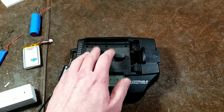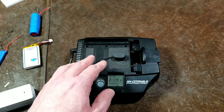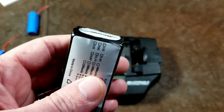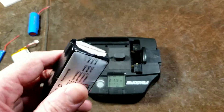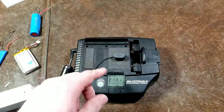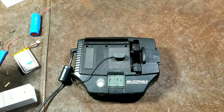This is not a balanced charger in what would be known in charging any chemistry. A balanced charger means that when you have a battery pack — like many power tool batteries, or maybe batteries like this, which is a 10.8 volt pack — it's like having three of these packs sandwiched together. So this is a series charger and it doesn't take into account that maybe one of these cells in here is a little bit weak.